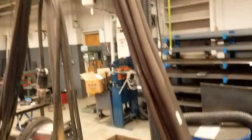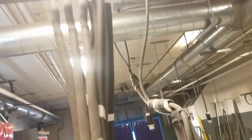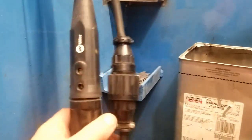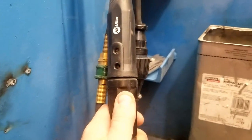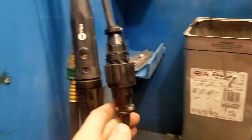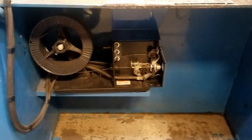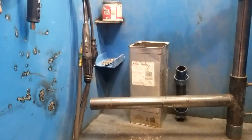That is because on the other end, if we go up here and follow all these lines, they come over the top of this tray and then around the booth, and eventually they come down and drop into the individual booths. This is where the wire feeder is hooked up. We have a gas line, a main power cable, and the control cable for the feeder. With stick, we don't need the control cable, and we don't need a gas line, so we don't care about those.